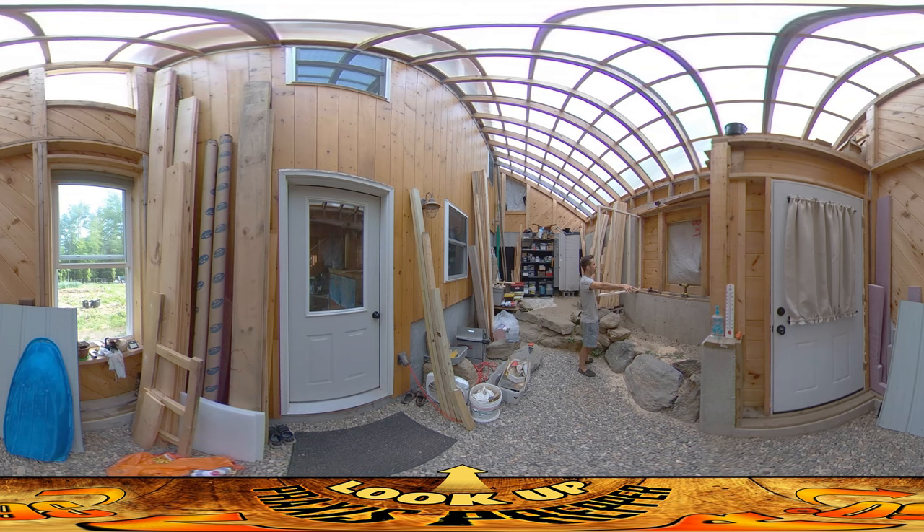You can sort of see the shape of it — it comes out four feet and goes a little bit over five feet in this direction. It still has that cantilevering kind of thing going on. I'm going to be working on leveling it — I'll be putting a board down here attached to the concrete at a 45-degree angle like an arm to hold it up. It won't weigh that much, just a chicken coop. I'll also be putting some cross bracing into it, and ultimately I could put a post here, which I probably am going to do.